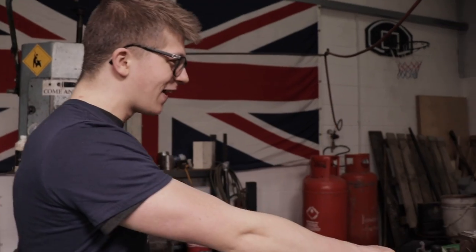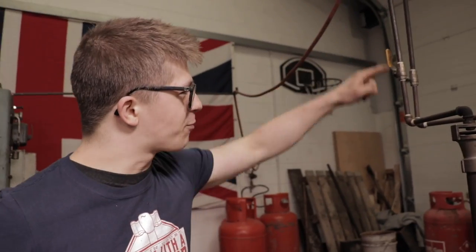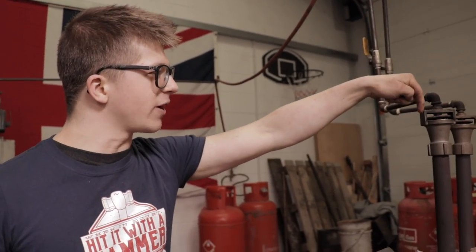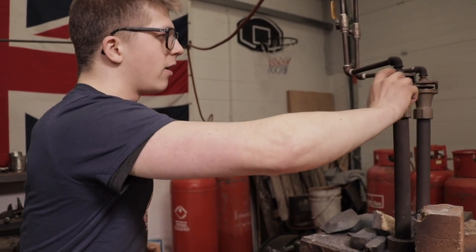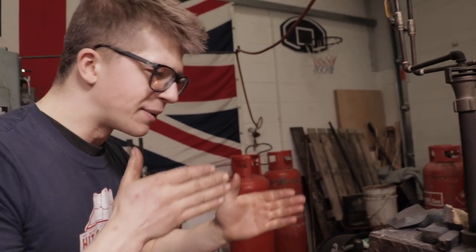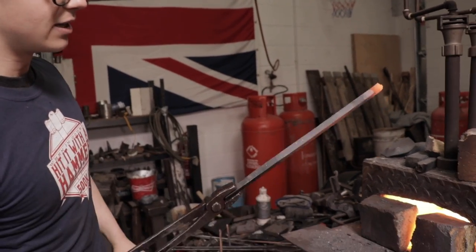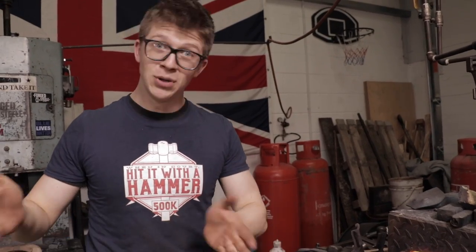The first thing is you need to be able to heat up your steel. Blacksmithing is all about taking metal, heating it up to the point that it's hot and malleable, and then hitting it when it is hot and malleable. First things first, we've got to get stuff hot. This is a propane fired forge, you'll often refer to it as a gas forge. Propane comes through this line, it gets shot out of a very small jet, this gap here on the choke controls the amount of air that gets sucked in, that makes a very hot flame, heats up this entire thing, means that we can put the steel in it and get it hot enough to hit with a hammer and move.